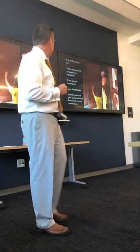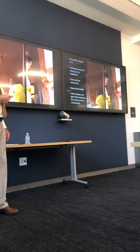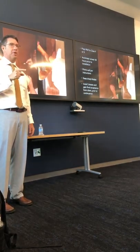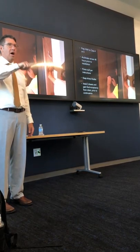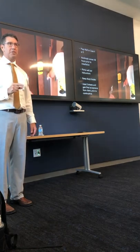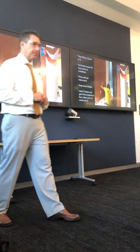Another cool thing is outlets — coordinating with the electrician and other trades. In the millwork business, we always had stress cracks coming out from outlets because the electrician would take a reciprocating saw and hog out an area for the electrical outlet, never mindful that he needed a radius to prevent stress cracking. With this system, it's easy to address those situations.